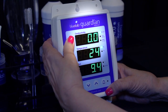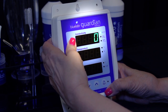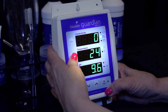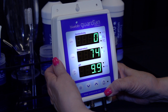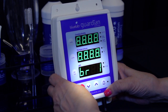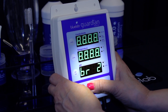Press and hold the conductivity unit button for three seconds to change the units. Release. Repeat until the LED glows next to the units you want to measure in. Press and hold the temperature unit button for three seconds to change units. Release. Repeat until the LED glows next to the desired unit. Press and hold the brightness button and at the same time press the up or down button to change the brightness of the LEDs. One equals least bright, eight equals brightest.